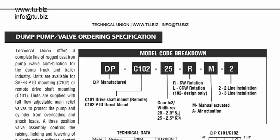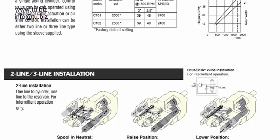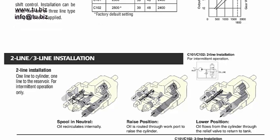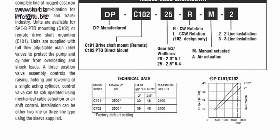There are two different sizes available: 5.1 and 6.4 cubic inches, in right-hand or left-hand rotation. The rotation choice applies only to the PTO direct mount, because the C101 has two shafts and can turn either direction. The manual control — this directional control valve — can be manual, activated with a cable, or activated by air.